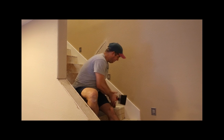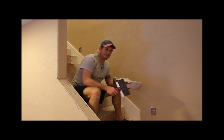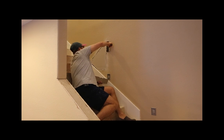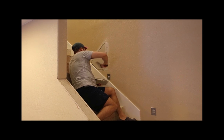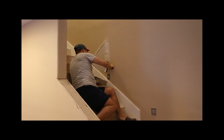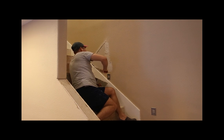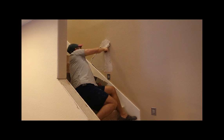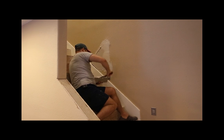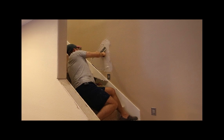All right, folks, so I've mixed up some mud. I'm out of 90-minute mud, so I had to mix it with some 20-minute, which is usually not a good idea to mix your types of mud. But in this case, it won't matter because I don't have a whole lot to do. So I'm going to scrape this on and then finish it off and get this done as quickly as I can before it starts to set on me.